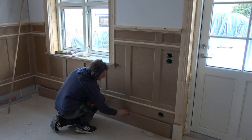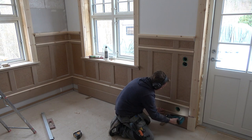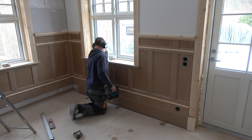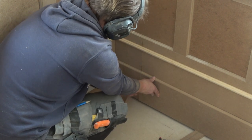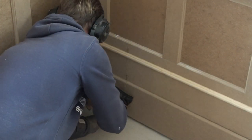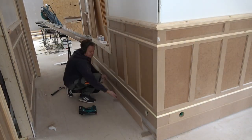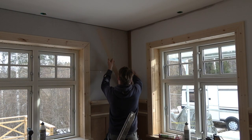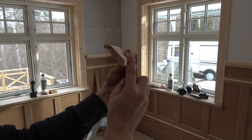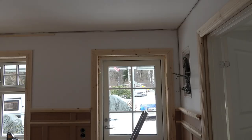I only attach the baseboard temporarily, as it has to be painted and the floor has to go on first. When you join something decorative it should be done at an angle — the angle hides the joint better and has a larger area for glue. I think it looks nice with corner moldings. If you do such, you will probably have to extend your ceiling moldings somewhat. You want the corner moldings to end up before the ceiling molding starts, otherwise it looks strange. I do this by nailing a strip to the wall to bring out the molding slightly, and I attach everything temporarily as they will be painted later.